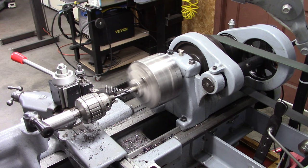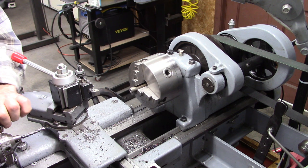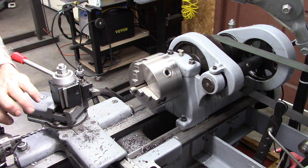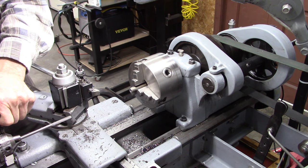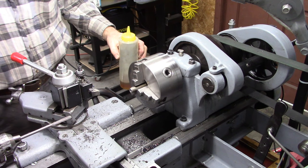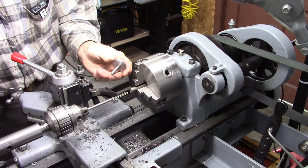I need to go about an inch and a half deep. Now that's undersized and I'm going to ream it to size. I've got a one-thousandths-under reamer here. That's one reason I'm going with just steel bearings instead of the bronze sleeve bearings. The bronze bearings are one and a half over, and this is two and a half under — two and a half under that shoulder bolt. Need that in back gear — good way to burn up a reamer.